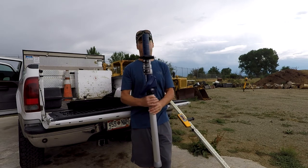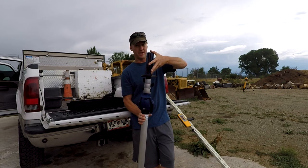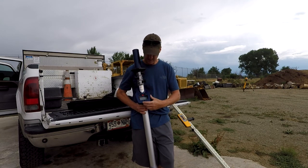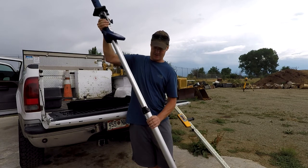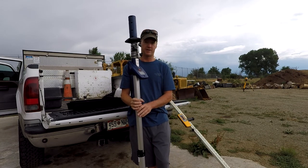The rod itself has a laser receiver up here at the top. It's a fairly wide space so it picks up a beam pretty easy. You get all your digital readouts on this display. It displays in metric, feet and inches, and in tenths. The base drops out and adds three feet to the bottom so you can get a nice working height — right now we're sitting about six feet high.